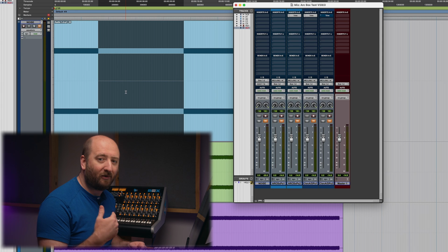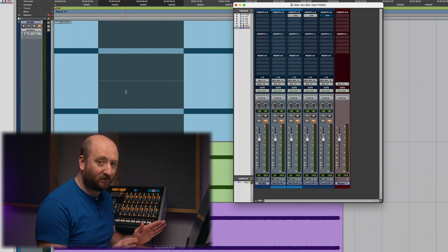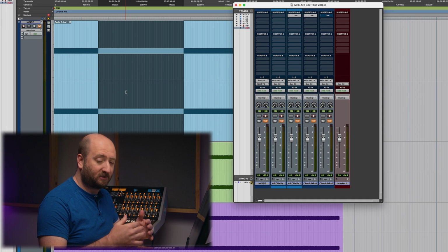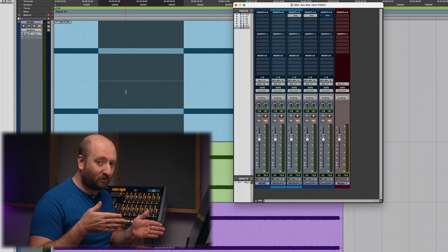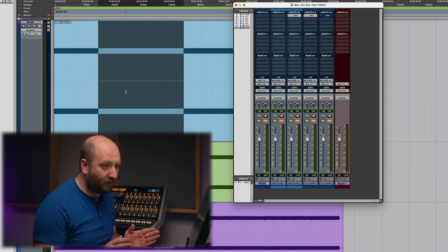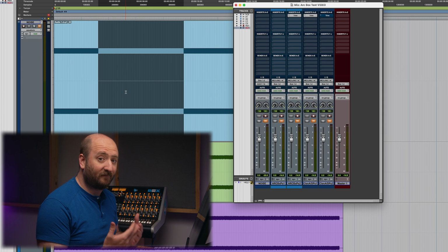I've gone out of my converters and back into my converters without the Arc in there at all. So I recorded a clean pass of my ADDA process. And then I also recorded a pass with the Arc hardware box in there so that we're actually recording the white noise through the Arc hardware with no EQ going on. And we're going to do a phase test.